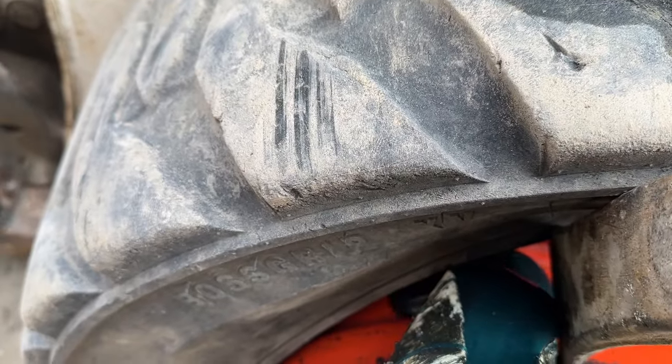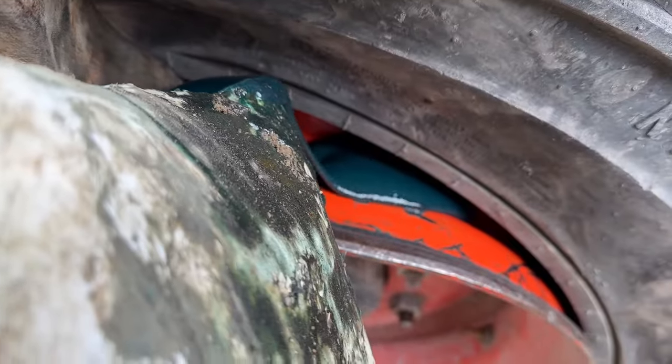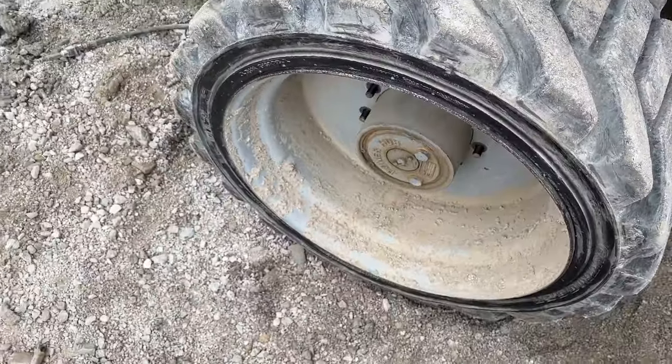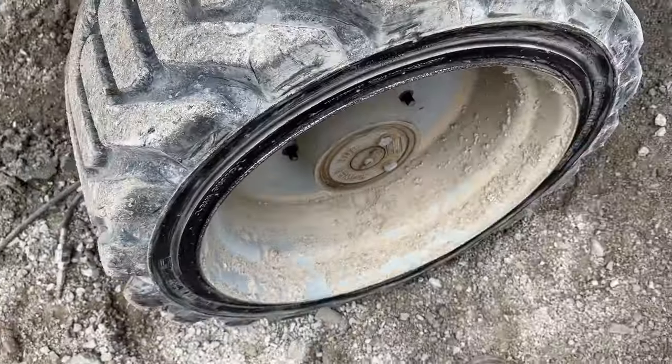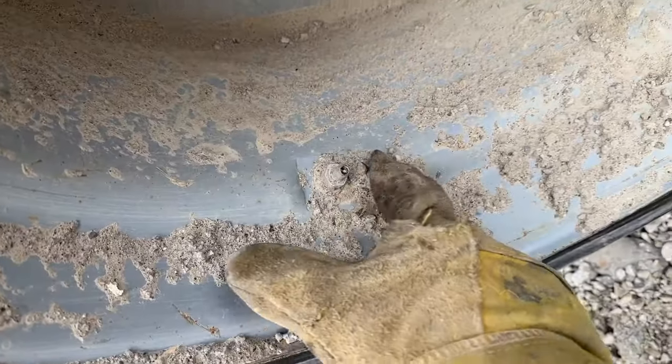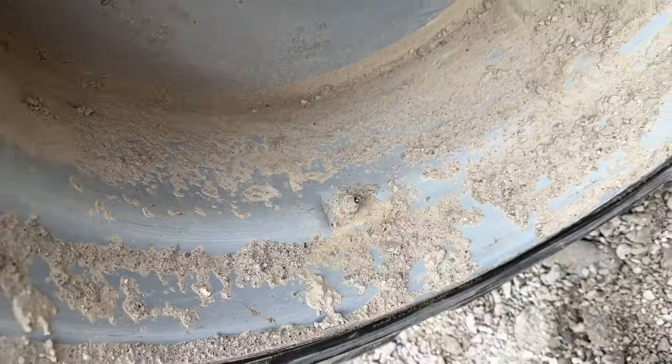This one here we got one of the worst and hardest tires to fix in the world — 355 625. First things first, jacked it up. We're also going to need to change this valve because there's no way I'm getting air into this thing without a jumbo valve. The beads are so tough that I actually have to drop the heavy unit onto the bead to access it, so that's what we're gonna do.